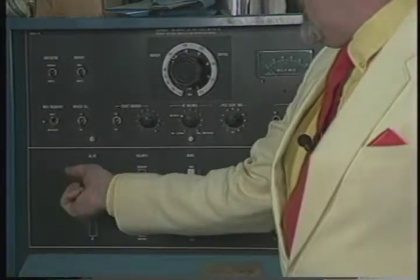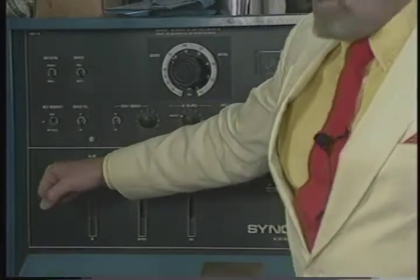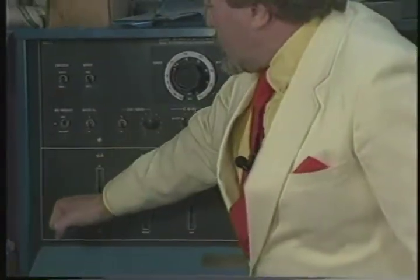And we've got it set up on AC, and I'm going to change it to DC because we're going to weld steel first, and then we'll talk about the aluminum. So push this control down to DC for direct current. One of the things, by the way, you can always tell when a welder using a machine of this nature is doing AC welding, you get a constant buzzing. It's noisy. Whereas DC welding is almost silent except for the flow of the gas. Okay, it's almost dead silent.